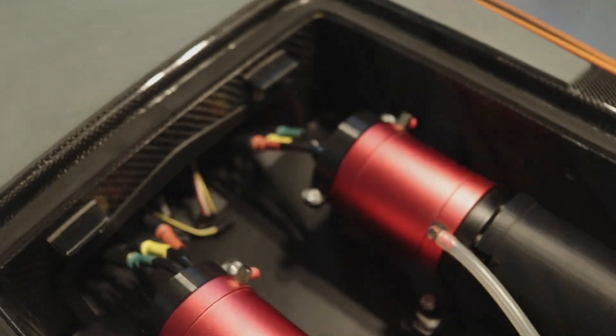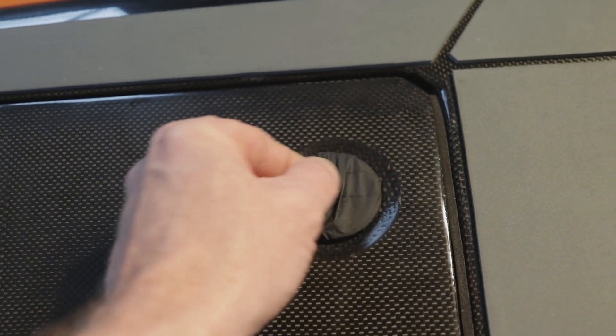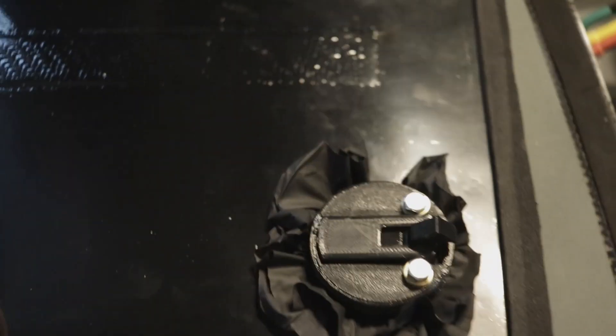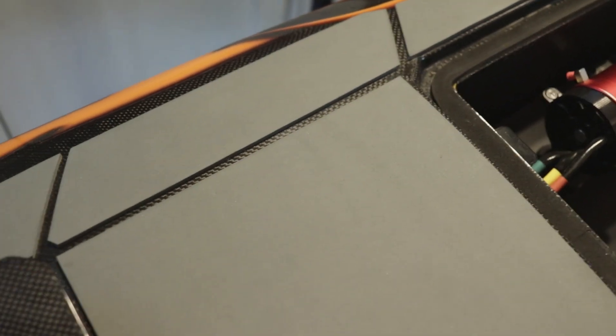I've got the hatches sorted. Anyone who wants to know — the slam latches I use: some black mechanical gloves, you know, rubbery ones, they last fairly well. You put the whole glove round through the hole and underneath, and you end up with a little bit sticking out. Cut the rest of the glove off and you end up with that there. The little clips are on — all 3D printed now, saving a little bit of weight. These go on, and it's just a backstop really — they clip on fairly easily. I've been down, water-tested, and there's no water coming in. Same at the back — a little bit of seal just to give some sort of backstop.